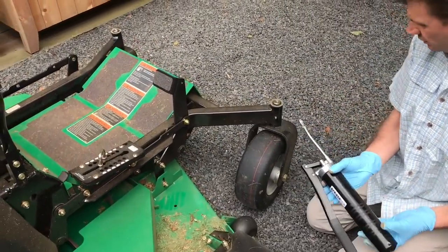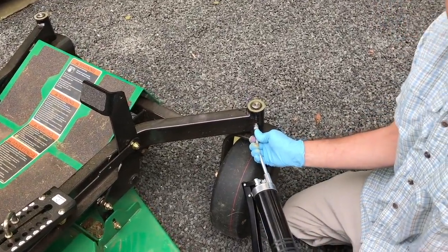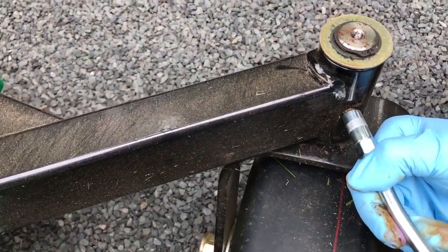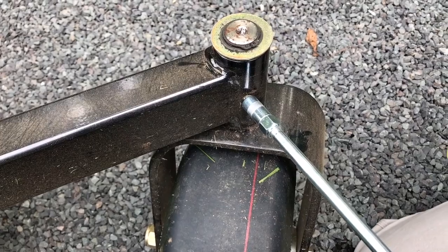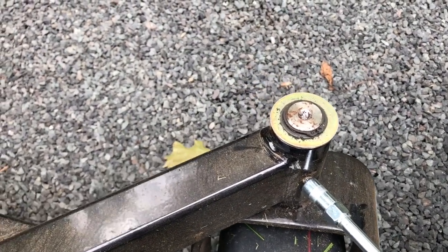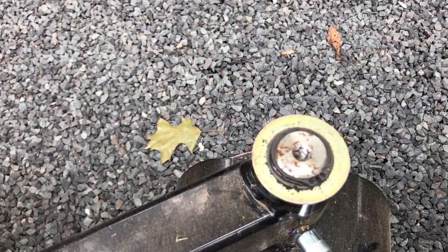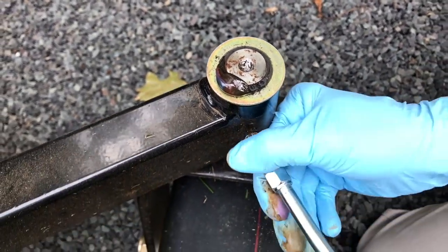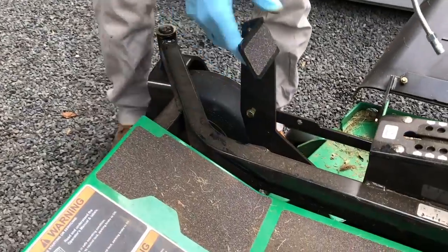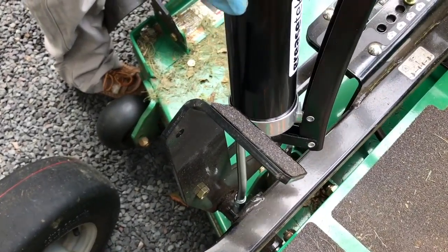There's the grease. Here's the little fitting — I forget what that's called — but I'm going to connect the grease gun to it. You just push it in and you'll feel the grease gun connect. Now I'm going to pump the grease and you'll see grease come out the top once it's connected. There's the old grease — and that's greased. There's one over here right next to the blade adjustment. Push the grease gun onto the nipple and give it a few pumps. I can already see the grease coming out.